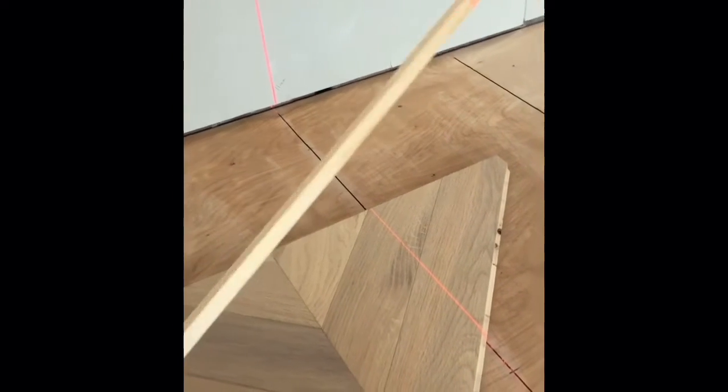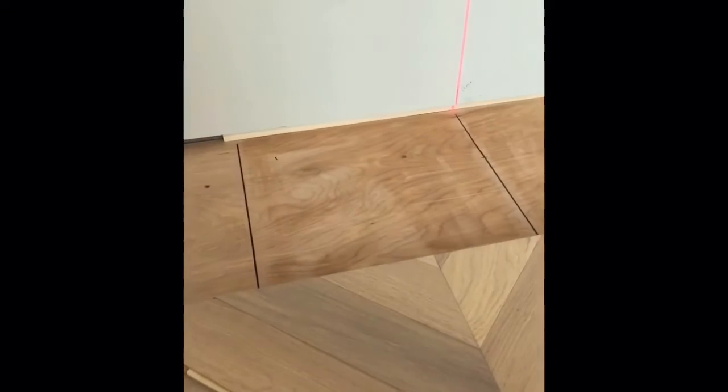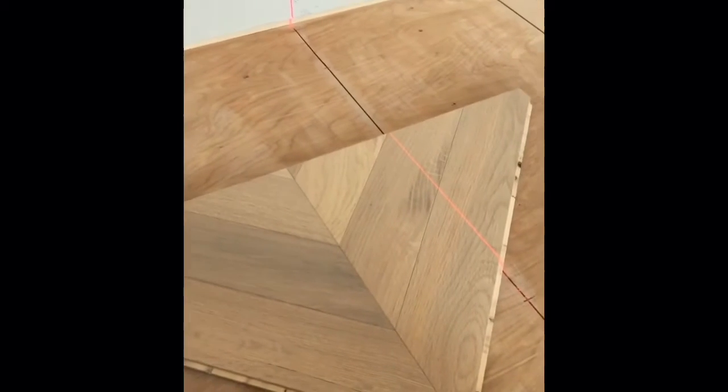So there we go, all cut, ready to go in, and then I've just spent a bit of time lining all that up and getting it in nicely. So then I'm going to put it here. I've got this piece of wood, which I know is actually 10.5mm. I can live with the extra 0.5mm above what I was going to do. So I've got this, and I'm just going to slide that in behind that, up against the wall. It's not that I think the wall is perfect, but it gives me a good starting point to then put my wood in place.